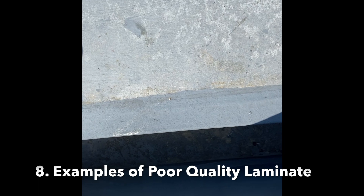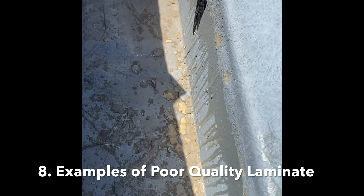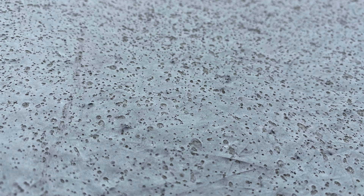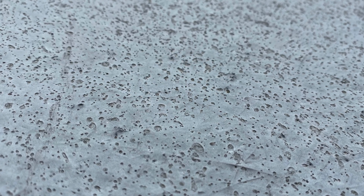This section shows what can go wrong with a fiberglass laminate. Whilst these examples show the final top coat after it's been applied, it's also important to note the condition of the underlying laminate. One example shows inadequate resin coverage, an absence of a seamless barrier between different sections of glass fiber matting — usually indicating no paddle roller and incomplete resin application — which caused the roof to leak. Another example appears to show the top coat applied during rain, or the underlying laminate used insufficient resin, causing the top coat resin to fall into air pockets.